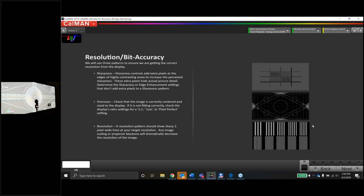And the idea is that those lines are free of any distortion. And looking at it from here, even if I look really close, the sharpness is already at the correct position for this picture mode because I don't see any distortion. And also at the same time, those lines don't look out of focus or too soft or too fuzzy. So for color and tint and for sharpness, I'm going to leave those at the factory default settings. Those seem to be pretty good.